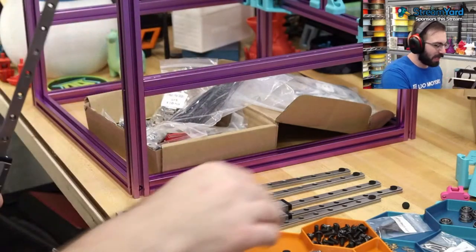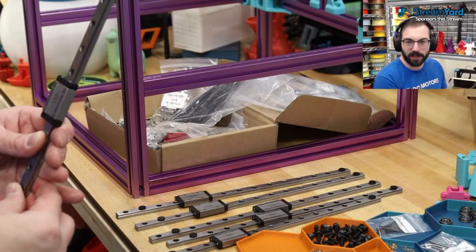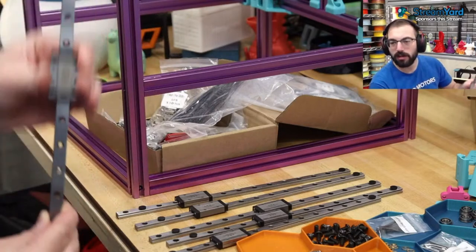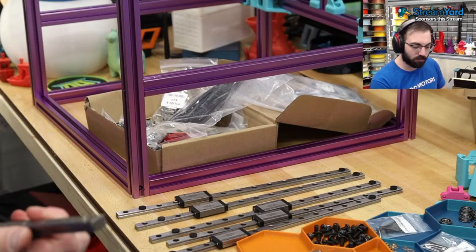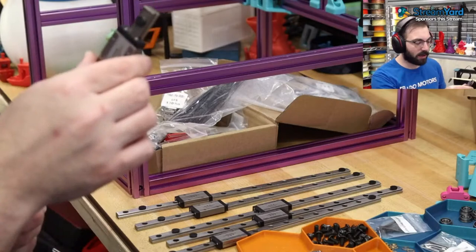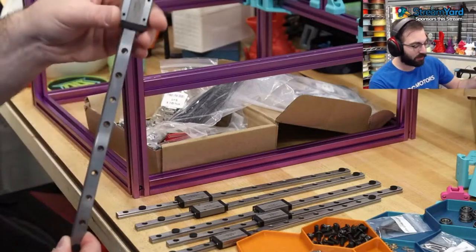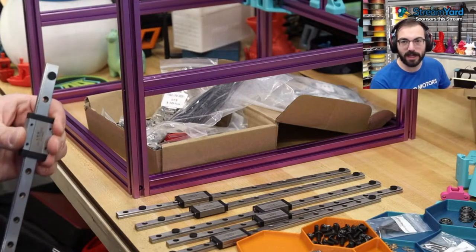It is better once lubricated, but still, it's a lot lower than the other rails I have encountered. So this is what happens when you lubricate it, but still, it shouldn't drop at all. Torsional play, probably nothing noticeable. It's probably perfect for a 3D printer, but I don't know. It's very smooth, extremely smooth. It's just not as stiff. I can't feel anything. It's not like it's loose. It's just not as tight as it probably could be.